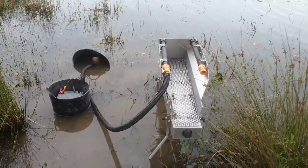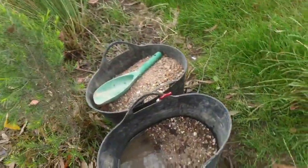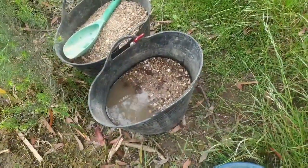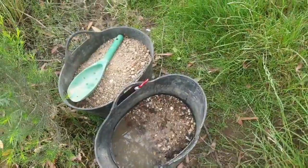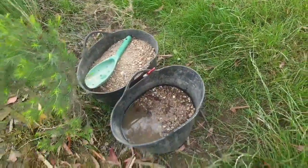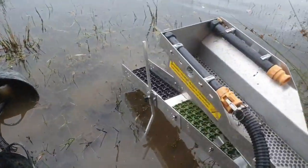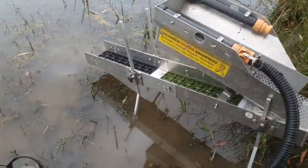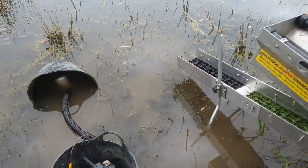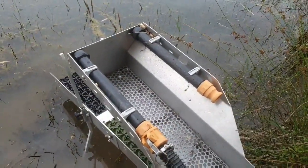All right, guys, just to finish off this last bit of dirt. So what I ended up doing is bait pumping half a bucket of gravel at the bottom of my hole. And that's me line dig. It's actually all dry. So what I've done is just set up my high banker, two dream mats, 2,000 gallon pump, and I'm just going to run out of one of the spray bars. Just going to feed it in slowly and get rid of this.